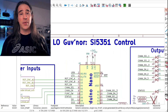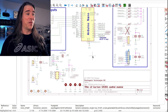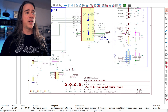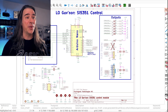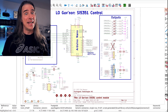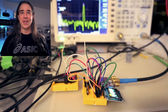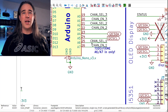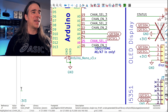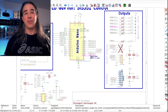Here's mistake number one, and I thought it might be a demo killer. I'm used to playing with 3.3V, and the power going everywhere — including to the external modules — is coming from the Nano's 3.3V regulator. But this original Nano is using 5V logic levels. The modules can handle 5V, but the circuit is powering them at 3.3V and then sending signals that are way above that when high. I wired it up on a breadboard prototype the same way and crossed my fingers — it worked. Another mistake: I tried to use A6 and A7 as digital outputs, but they only do analog in. So I botched it up on two available pins, and we'll fix that too.